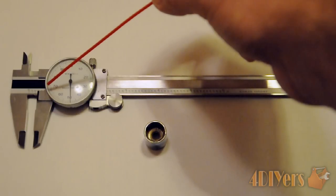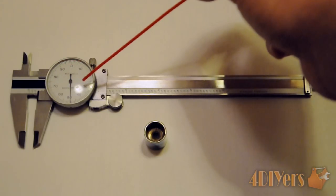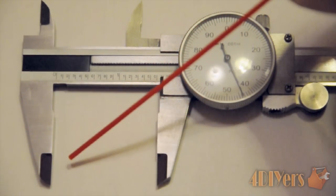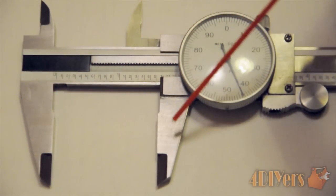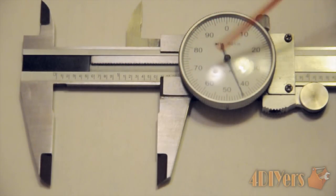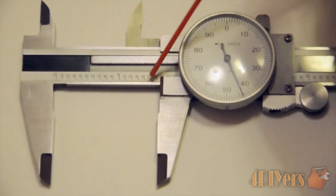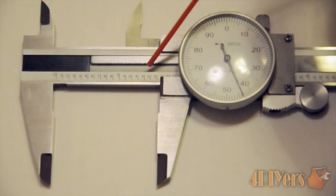The scale also measures the first decimal place, which is the tenths, and the dial indicator is used to measure the hundredths and thousandths increments. As for maintaining your caliper, always keep the jaws clean before every use. Handle it with delicacy — don't drop it because that can affect accuracy and damage the jaws. Inside there is a small gear that operates the dial itself, and you always want to add a little bit of lubricant oil to ensure everything works correctly.